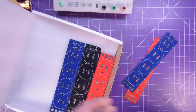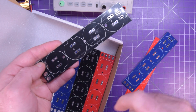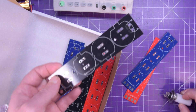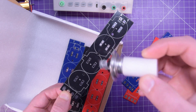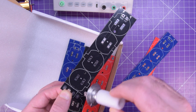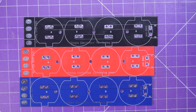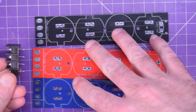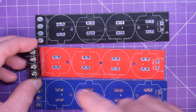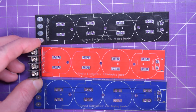So again, four bulbs. And I've got this black one, which is a 48 volt load where all four are actually in series — one, two, three, four. So you can get high current at whatever voltage you want, because these bulbs are made for automotive use. You could go up to 14 or 15 volts apiece, and at 15 volts apiece that makes this a 60 volt compliant board. The boards use screw terminals with two positives and two negatives, so you can hook up your power supply to two terminals and use the other two to daisy chain these boards to as many as you want.